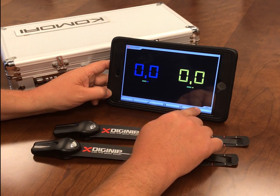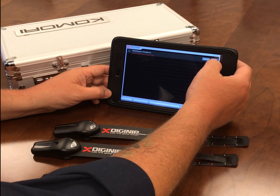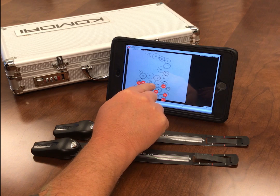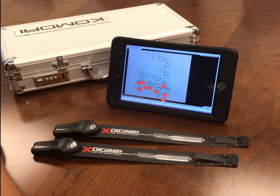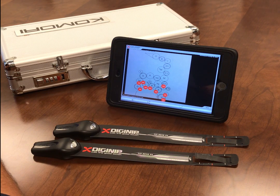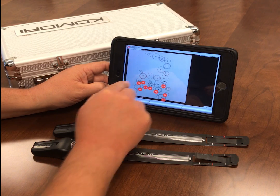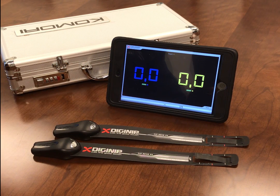What I've already done — if I come back in here under Campaign — I've saved the roller chart for the Komori GL 40-inch press. I come into Measure and it pulls up my chart, and here are the settings that we want for individual units. There are a couple I haven't programmed in yet. But when it comes to actually setting up, I pull up this chart — it's very nice for people that don't have the roller stripes memorized, maybe they're a little new. So I pull this up under Campaign and hit Measure. Now if I tap on that, that's a 4.0 millimeter stripe. Up here at the top, my target — it actually tells me what I'm shooting for, which is a very nice feature. Makes it easy.